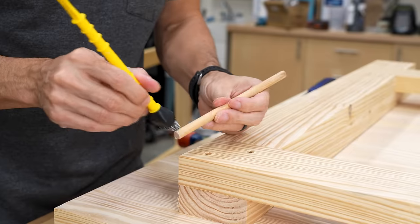Here's a little bit about how I'm going to use the workbench and some of the design considerations that went into it. The size is really nice — now I can fit my 31-inch parallel clamps across there; before they would fall off my old bench. With the dog holes there are a lot of different clamping options, whether I want to put something on its edge for a block plane, or use dog holes in front to hold a panel in place while sanding. My favorite way of clamping is using face clamps, so I left a large overhang all the way around the workbench. This thing is so thick and sturdy — super heavy. I left the shelf below open because I aim to add some modular storage down there. I'd love to hear your ideas on that. Plans are available — link below. Get out there and build something awesome.